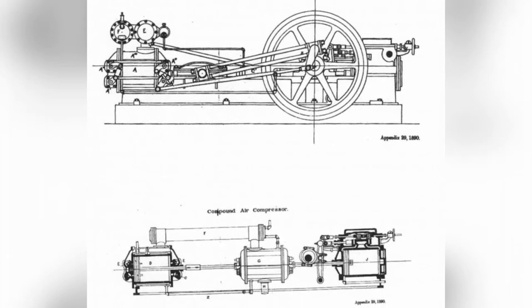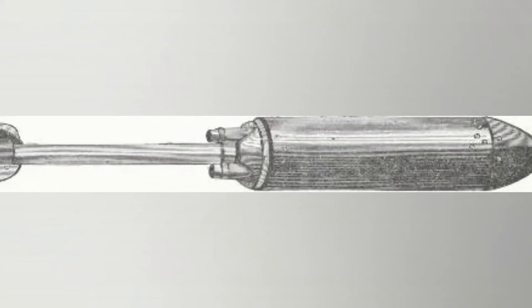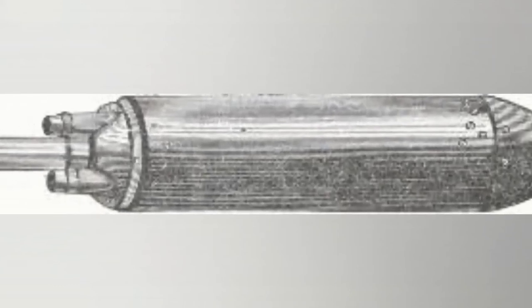The artillery had a breech-loaded rifled gun barrel. Because the firing pressure was not as high as conventional artillery, the barrel wall thickness could be smaller. To prevent the barrel from bending, a support structure similar to a rifle stock was installed under the front barrel.